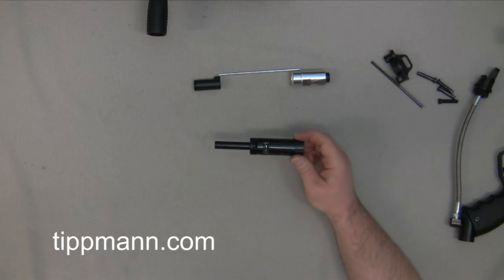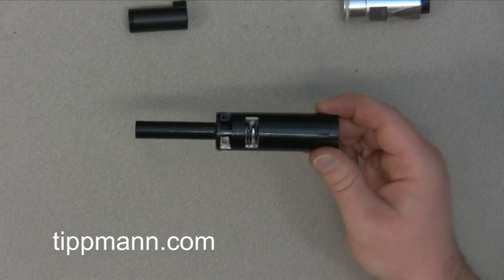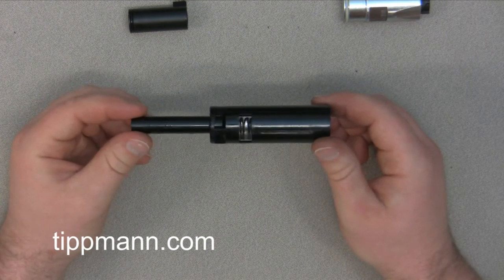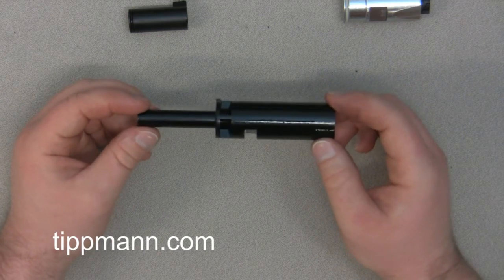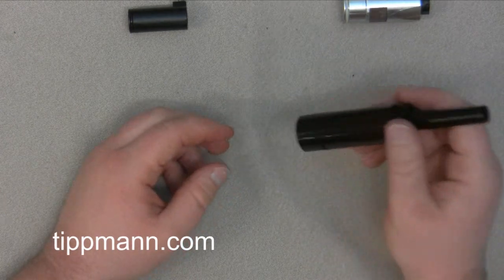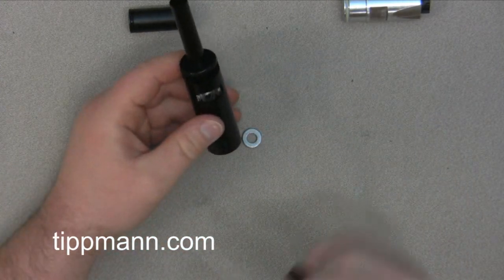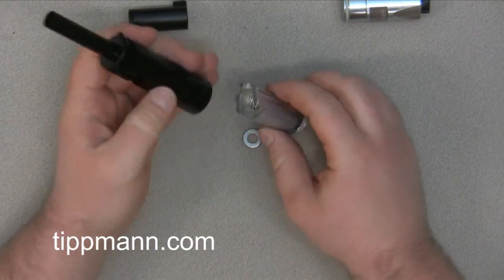What I have in my hand is the power tube assembly — here's the power tube assembly. Your valve is actually on the inside of the power tube assembly. A lot of people call and say that their power tube is leaking, but it's not the power tube. The power tube is just a plastic piece that houses the valve. The valve is usually what's leaking, and as you can see that was our valve washer that fell out. I think what's wrong with this particular valve is that it was just reassembled wrong, and we'll go ahead and take a look at that.